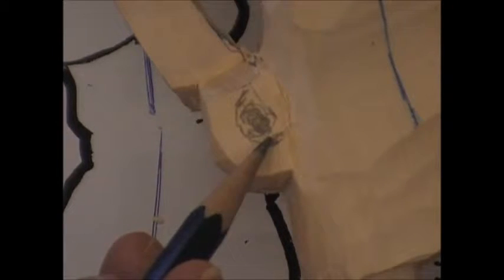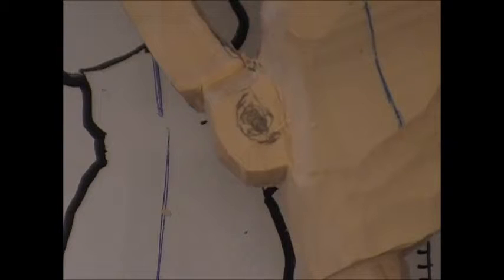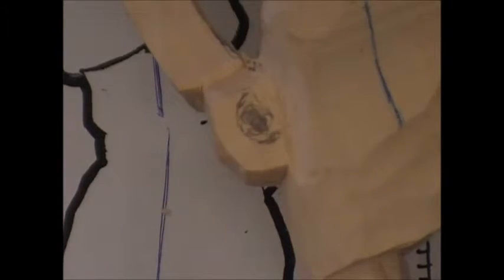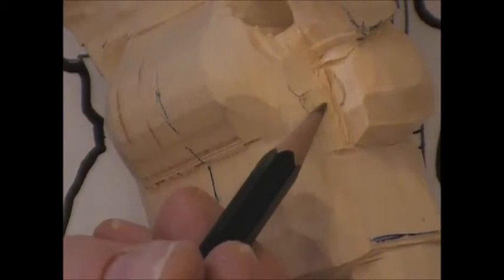So this is going to be eventually all hollowed out. So get the outside shape, and then worry about the inside shape. So if you can get that established, your homework would be to drill a hole through there. No, I would suggest that you drill it just past halfway on the front, then turn it around, and then drill it halfway on the back, because notice how you're going to have to get into the back a little bit. Okay? And don't drill all the way.